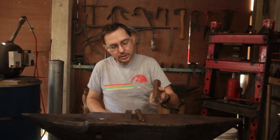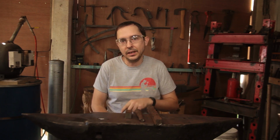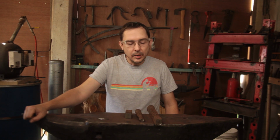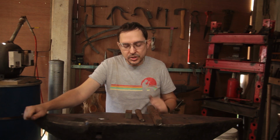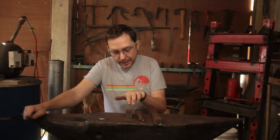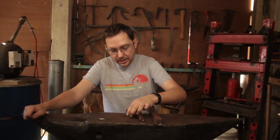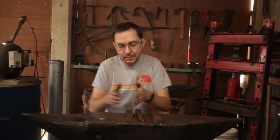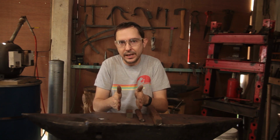And then I've got a little bit more of the axle, which I will forge out to form the heel and the horn. And then I'll forge a little bit of the spring steel that I've been using for gouges and pizza knives and whatnot, down to give me appropriate dimensions for the faceplate. Now I'm aiming for about a 20mm wide face. So this is too wide, it is also too long, but I need that extra mass to give the width for the body of the anvil.